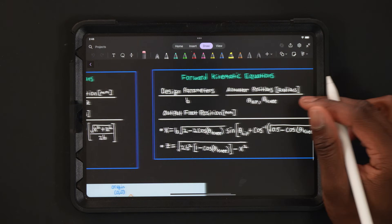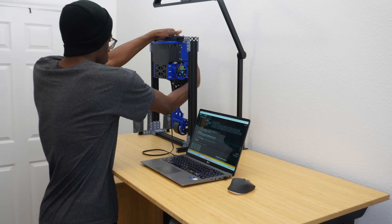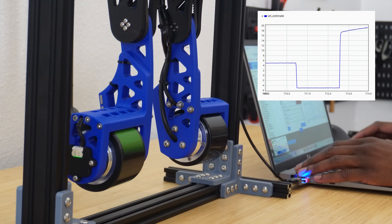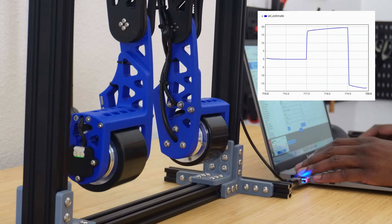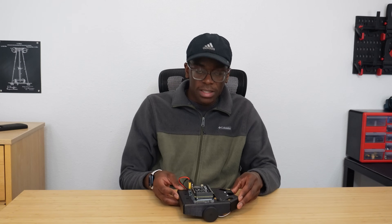With the robot built, I redid the inverse kinematic equations and started working on software. We're going to have to reliably control the velocity of the hub motors despite any friction or external disturbances. This required a bit of controller tuning, but eventually I got these beautiful velocity versus time curves. Now the big question is: how do we get the robot to balance? The answer lies in controls — simply put, the study of getting systems to act the way you want them to.